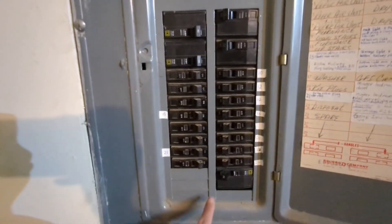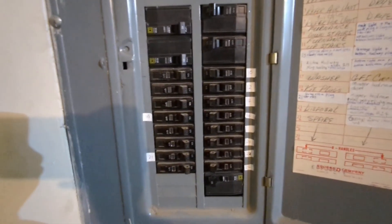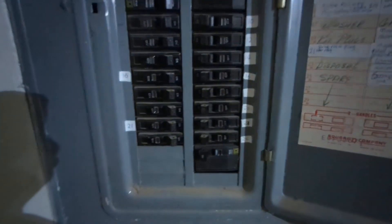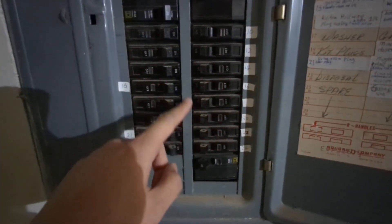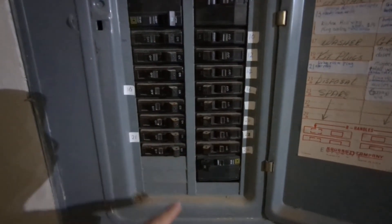The way to troubleshoot is by just switching the breakers one by one to determine which one the buzzing sound is coming from. In this case, I determined that there are three breakers — 20 to 24 in my case — using the buzzing sound, so I'm going to try to fix that.